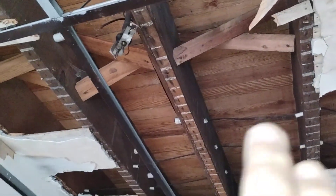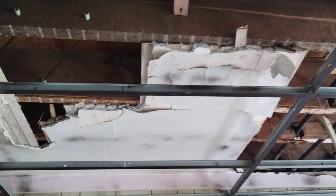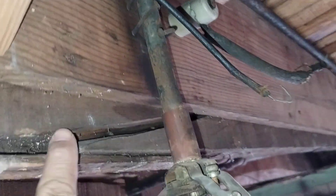See the splits? And on this side too, there's one split. And the middle going down, that's a split. Now they did put bridging in here - blocking, bridging. And so it looks like this fracture happened some time ago.